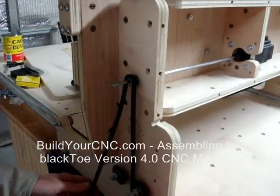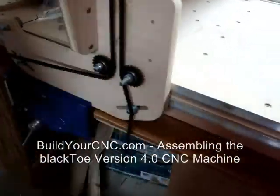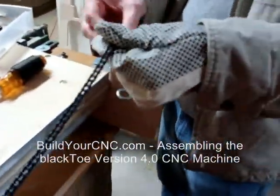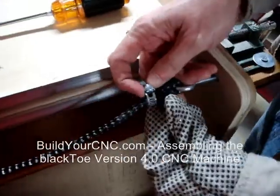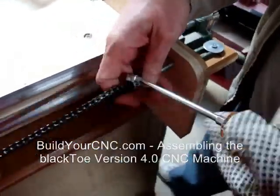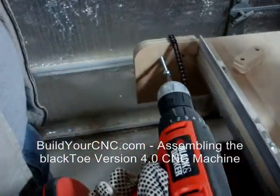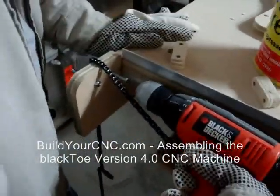Route the chain over the drive sprocket and under the idler sprockets. Add an eye bolt to the side with the horizontal slot — this horizontal slot will allow for a side to side adjustment. Bring the chain through the eye of the eye bolt and string it through the small hose clamp. On the other end, fold the chain over the edge as shown and use two 1/4 inch screws at 2 inches in length with standard nuts and the small wooden piece with two holes to clamp the chain in place.